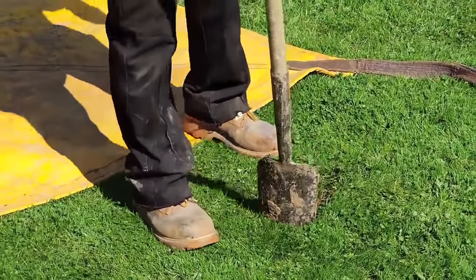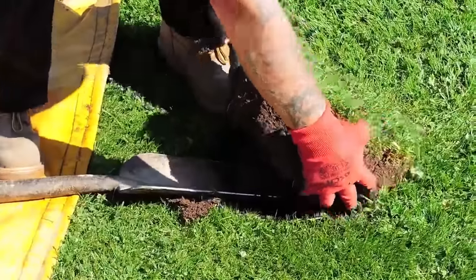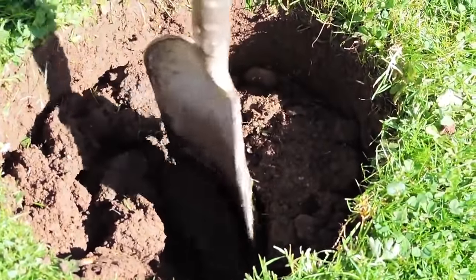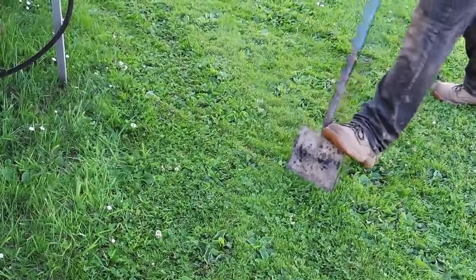Work commences to dig the post hole. The first meter is always dug by hand to avoid any cable or service strikes, and the auger is only deployed once this depth has been achieved. At the same time, a trench is dug for the cable to be laid to connect the mains power line.